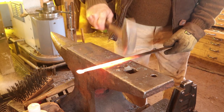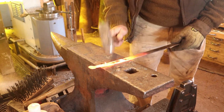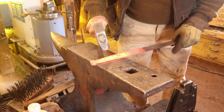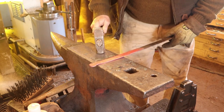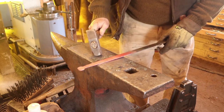With that side down, I just forge a bevel along the length of the strap. I'll also file this bevel in cleaner. That helps establish which side is the top of the hinge and which is the underside, and hopefully it gives me just a little bit less filing.